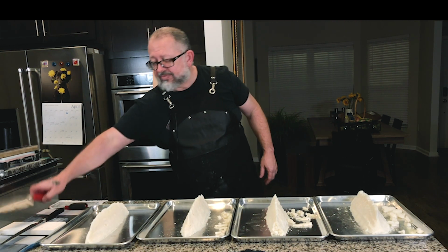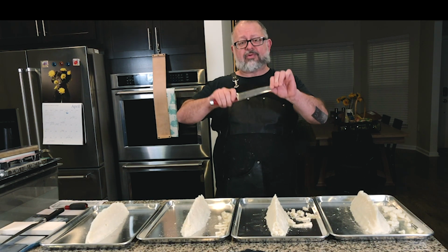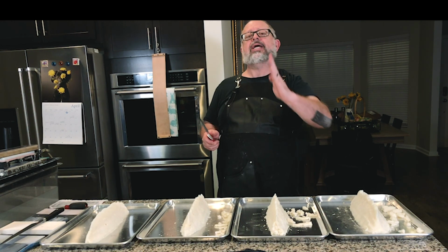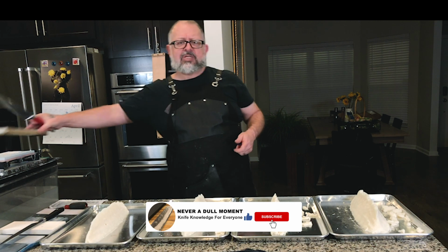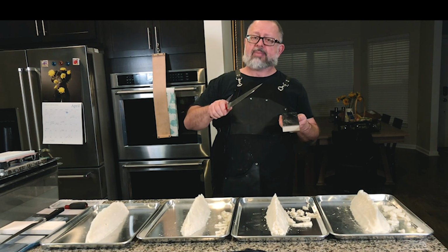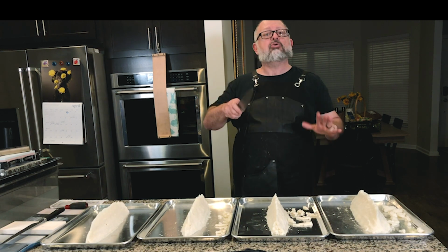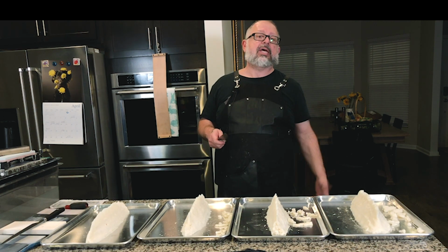And so if this inexpensive knife by KitchenAid, or even some higher dollar knives that have a little bit more flex, some Wusthof, Henckels, what you're going to want to do is, the burr that has the tall, thin wire edge, as you go to do a normal stropping, especially with just leather, you will end up making the burr longer and thinner, but you will never rip it away at the base. Okay, so this is actually going to give you the illusion that you've done something, but then you get that thin edge that the moment you give it to your customer, it's so sharp, and the next day it's dull. You don't know because you've been paid and you left. They're the ones that have to figure it out.